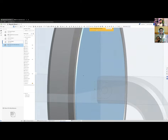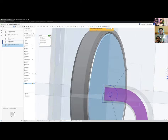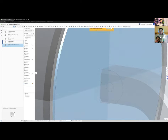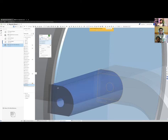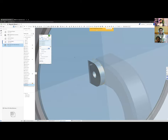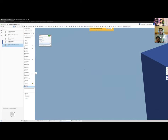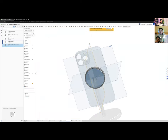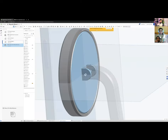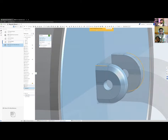The pivot ear is a bit smaller than the tube — I'll increase it to match the 8 mm tube width. I'll extrude the pivot sketch by 2 mm, then mirror it using the center plane so there's a symmetric pivot ear on each side. I'll add chamfers to the edges for a clean finish. The pivot point is now built into the arm.